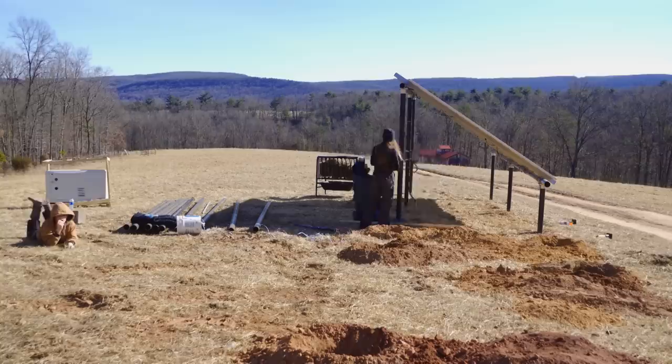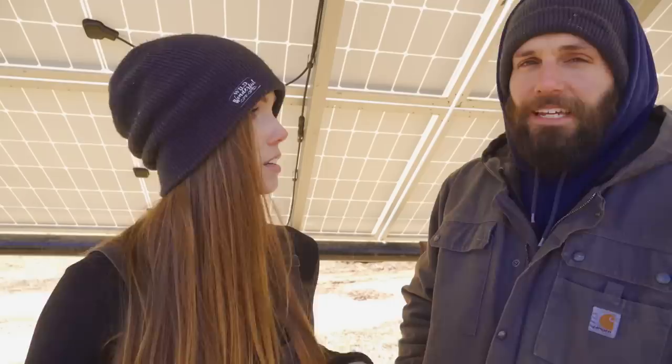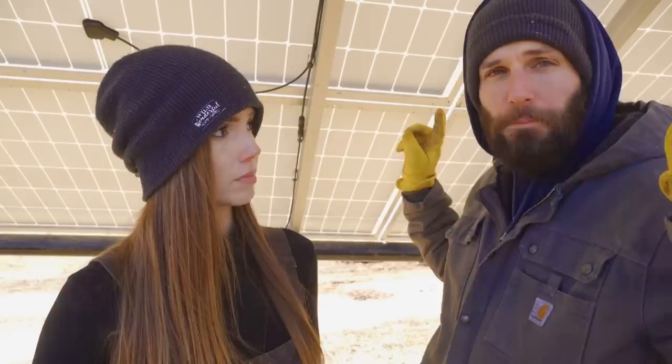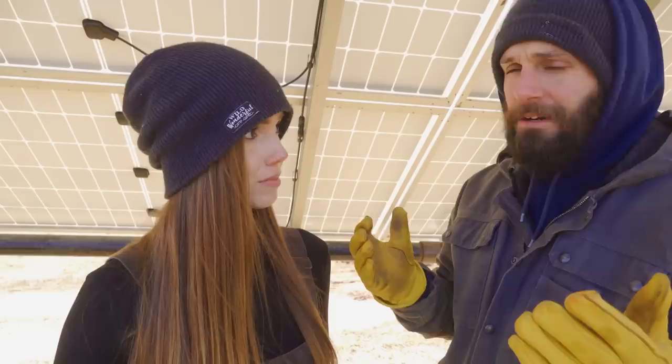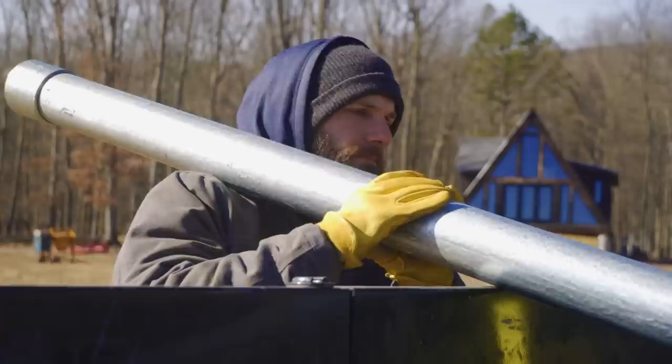We got all of the holes drilled, and then we went through, cleaned them all out, and measured to see what lengths of galvanized pipe we were gonna need. So we're getting ready to start cutting those. Yeah, so we have galvanized pipe that goes into the ground to help from rust, and we actually have the black steel pipe that goes across horizontal. We don't really anticipate that rusting nearly as bad as going to the ground, and plus it's a big cost saver for us doing it that way versus all galvanized. It's very, very expensive when it's all galvanized. Yes, but we did get black paint. Yes. So everything's going to match. So you're going to see us cutting silver pipe, but that's not the way that it's going to look when it's in the ground. It'll be black, all said and done. But all match. Yeah.